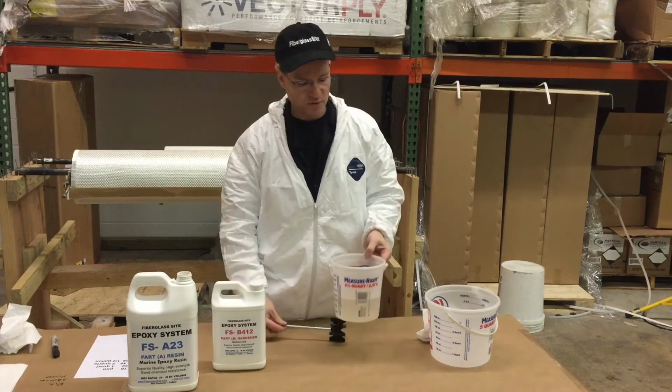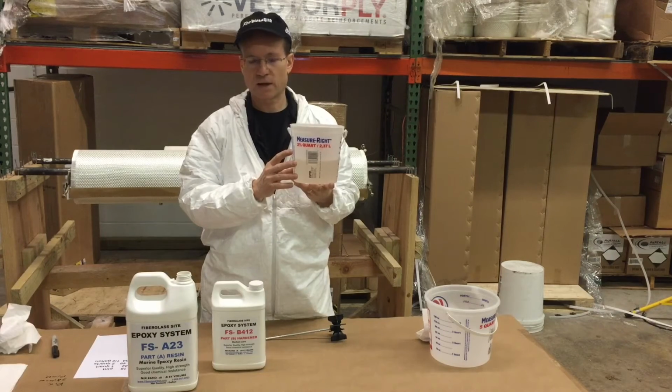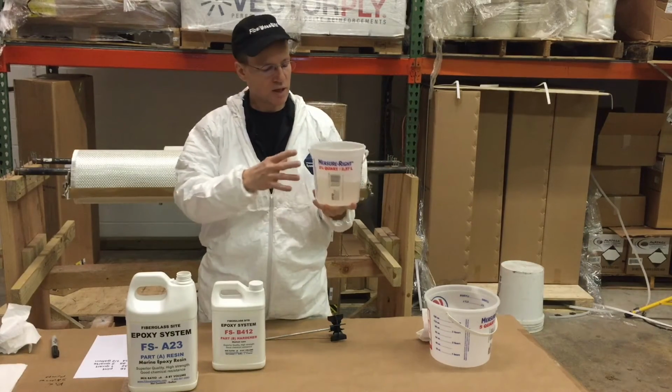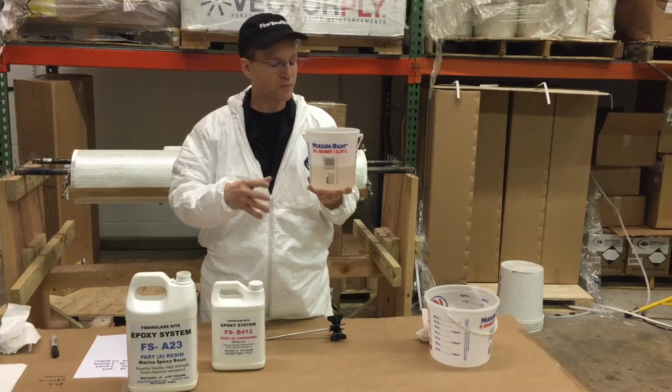Once you've mixed it up for 3 minutes, at 77 degrees, you have 45 minutes of working time. And that means if you pour this out onto the surface, you have 45 minutes until it turns to a gel and you can't work with it anymore.